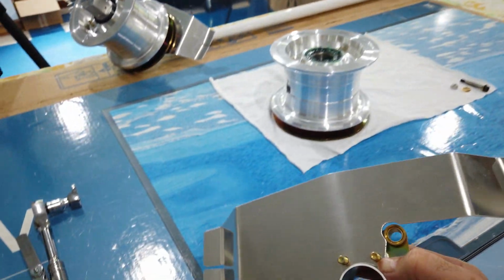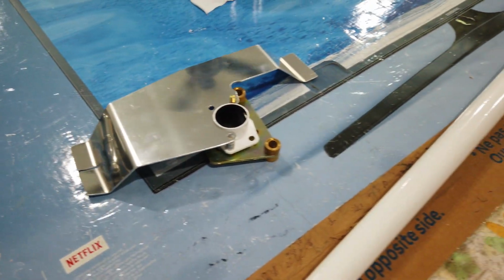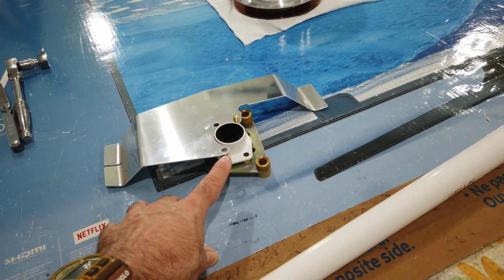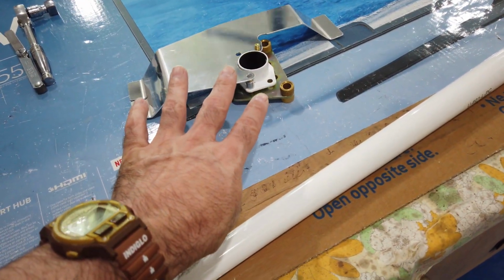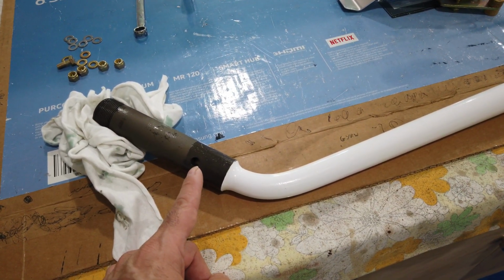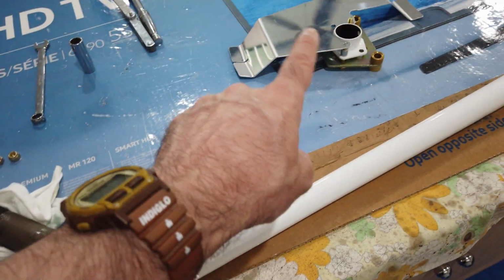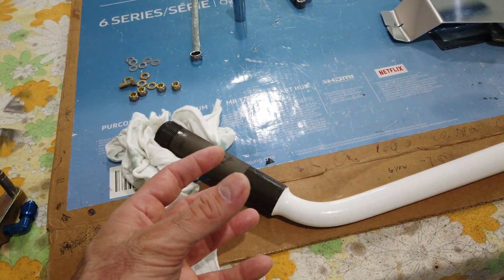All right. So now at this point, I believe I can start doing a little bit more pre-assembly. You have to have these parts actually bolted together. So I'm going to go ahead and bolt these three pieces together, and then I can fit them on the axle. You have to have these bolted together first because you can't put the parts on and then put this bolt through. You can't have this flange bolted through the axle first. You won't be able to get the other parts on. So you have to build these up as an assembly and then put this whole unit on as a whole.